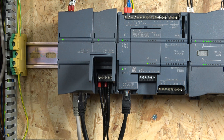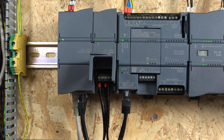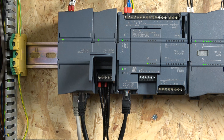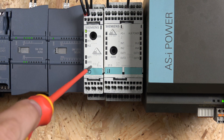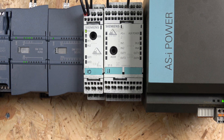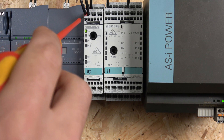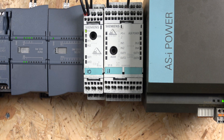The two ASI plus and two ASI minus connections are essentially the same — they allow voltage to come in and then pass on to the next device, and the next device, and so on. As you can see, those cables come into my slimline unit. One slimline unit has two outputs and two inputs; the other has four inputs and four outputs — we'll check those out in future videos. When it comes to topology, ASI doesn't really care — you can connect devices in any arrangement you want.